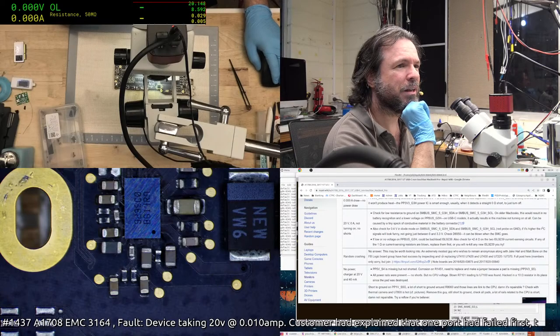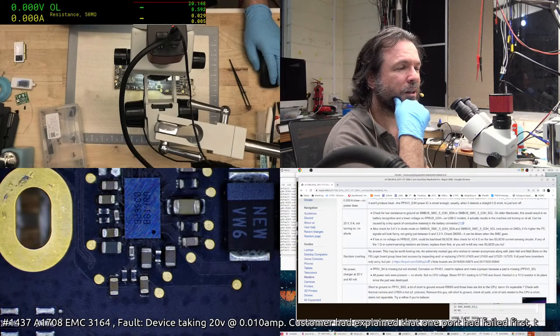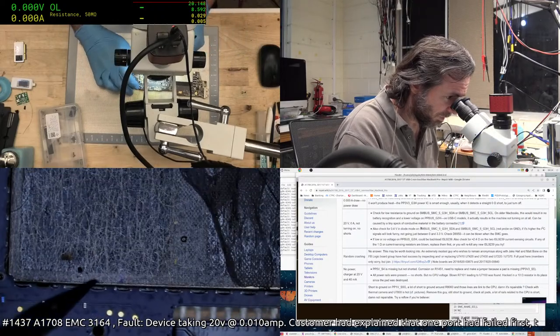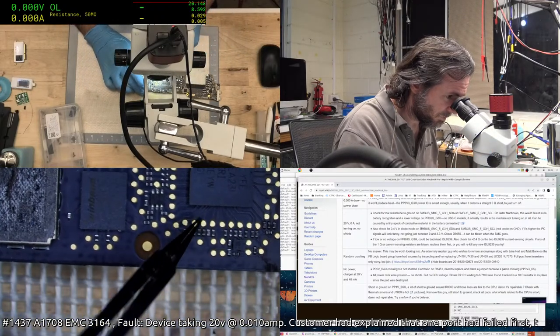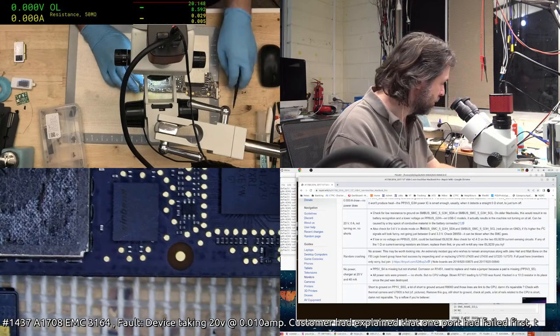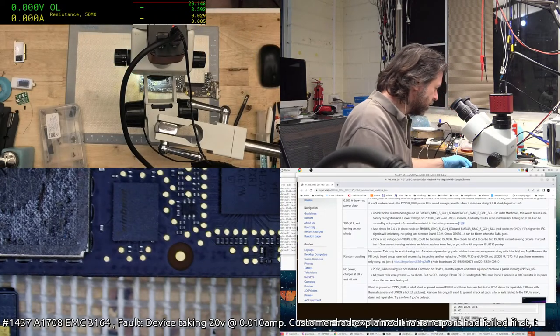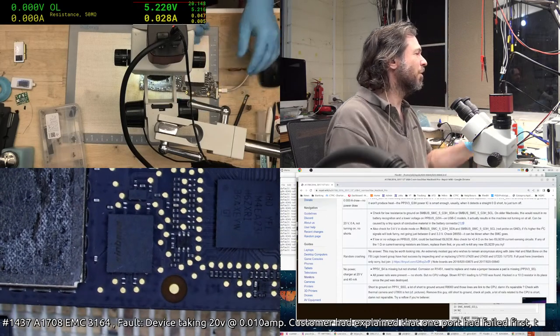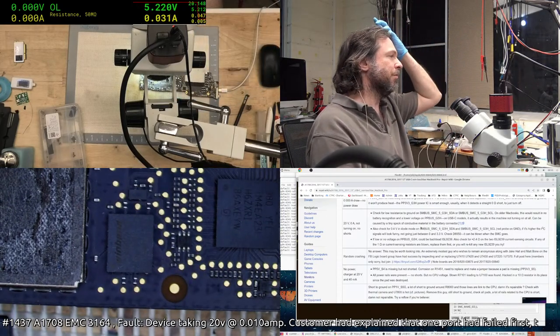So everything here checks out. I could try another ISL 9239. Let's check the voltage on those I2C lines and see if they are similar. It's like here for the clock and data. If there's chitter chatter on the lines, they should be sort of kind of... well, the clock should be about half the VCC.